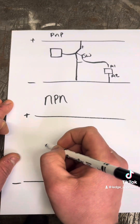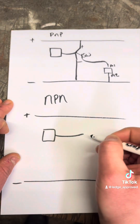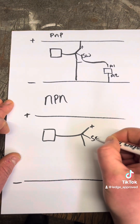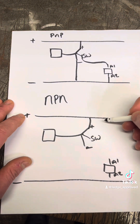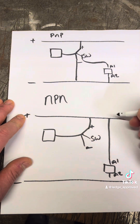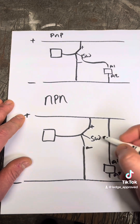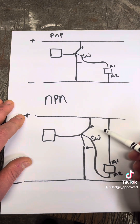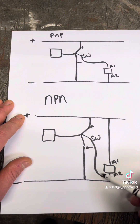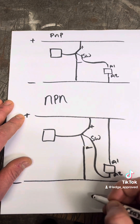Where on your NPN, you've got your plus, your zero volts, you've got your coil down here — A1, A2 — your sensor up here, three cables still coming out: plus, switch, zero. So you're still going to have your common 24 going to your sensor, now we've got a common 24 going down to your coil on your A1. Zero's going down to your common zero, but this time round your switch is going to be going down to your A2. So what this is now doing is you've got a common 24 on your coil but you've not got a path down to zero, because A2 then switches the transistor and it makes you to zero volts.